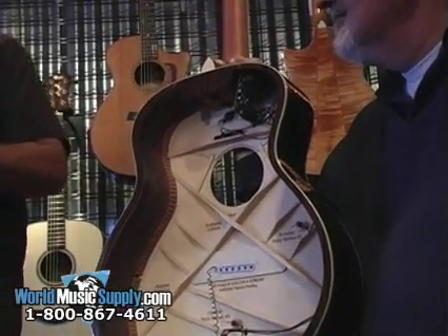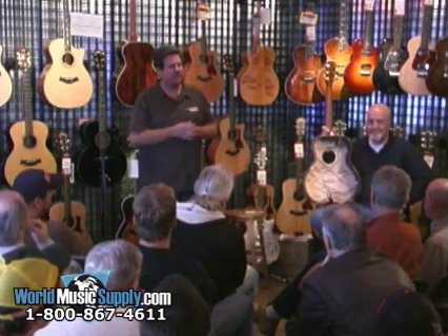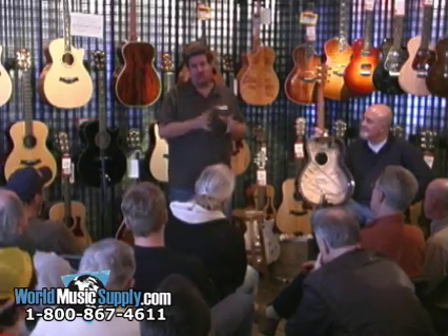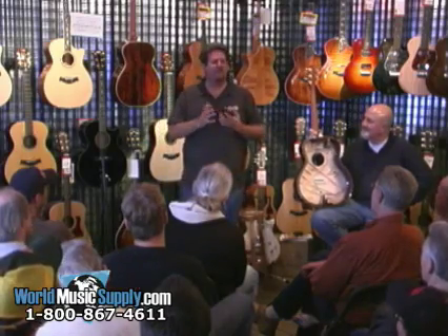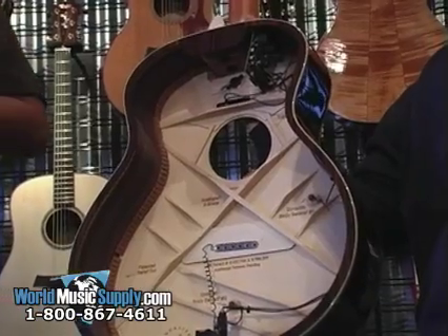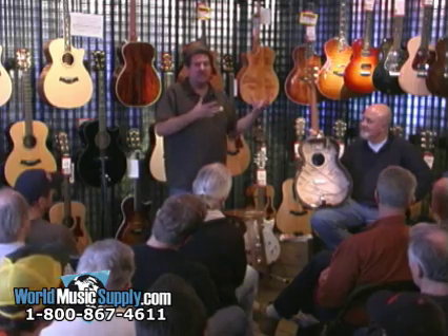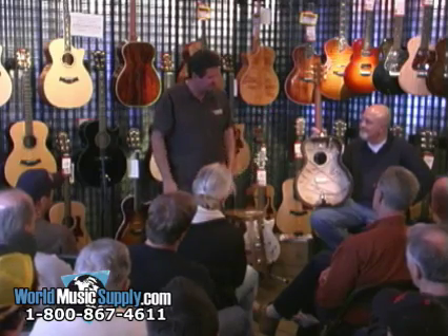The system had a major redesign in 2006. After three years, we decided that people in Europe would like to have it as well, and we had to comply with the Restriction of Hazardous Substances — RoHS standards for Europe. They were concerned about electronics ending up in landfills, so the rule says electronics must be landfill friendly. That meant everything had to go lead-free: no lead in the solder, no lead in the components, no lead in the leads coming out of resistors and capacitors. That allowed us to redesign and update the system, sweeten up the top end a little bit, and change the power supply to a 9-volt battery.